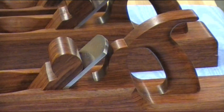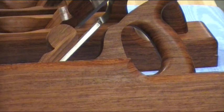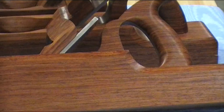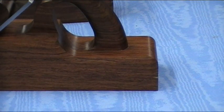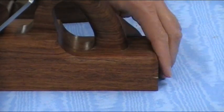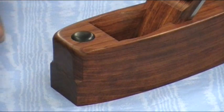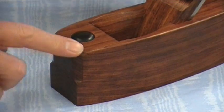Here's a closer look at the wedge and the tote — you can see the chamfer on here. The back end on the jack and the jointer have a half-inch round over. I didn't use a chamfer on the top of the smoother; it's chamfered on the corners but just rounded over on the front, the heel, and the sides.